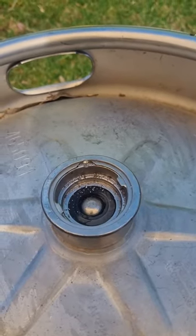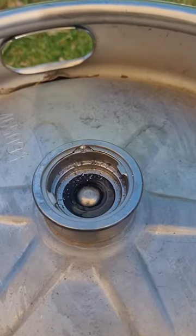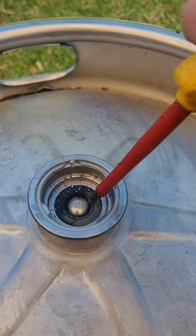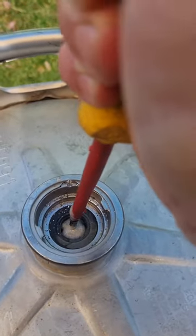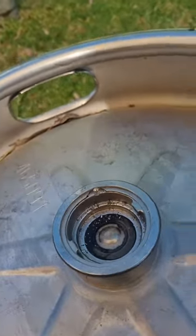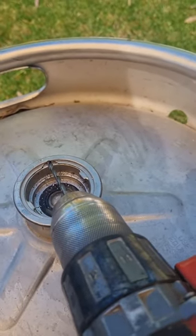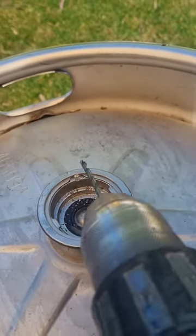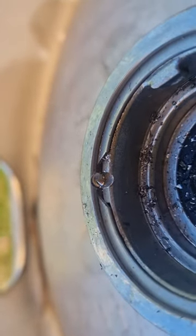This is how to get your spear out of your Sankey keg. Get your screwdriver and let the pressure off, then get your drill and go in at an angle and drill into the circlip seat — you want to go past the race where the circlip sits.